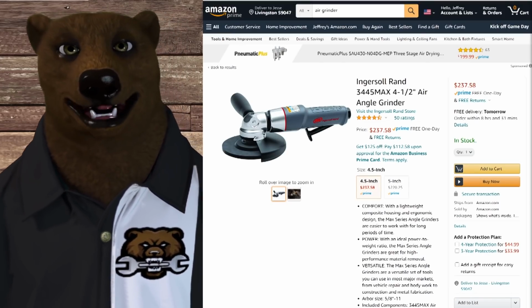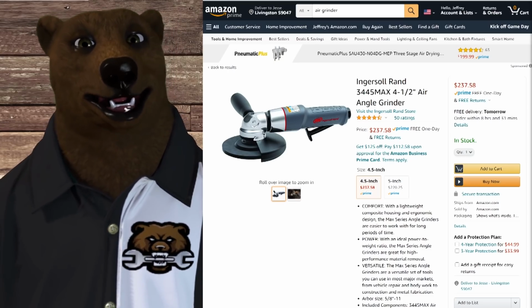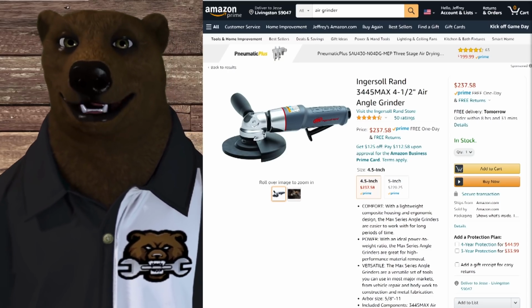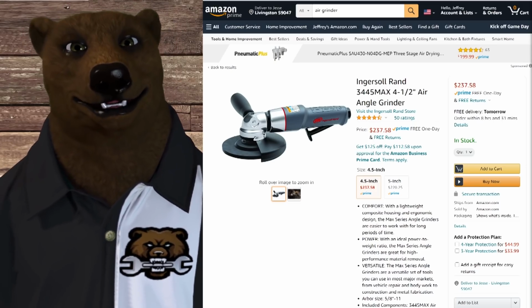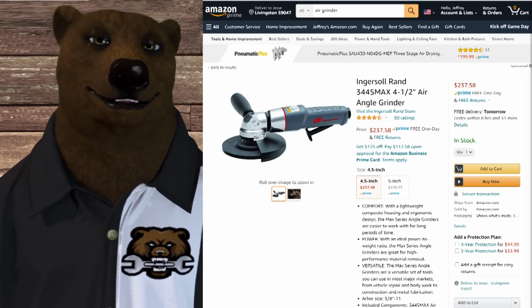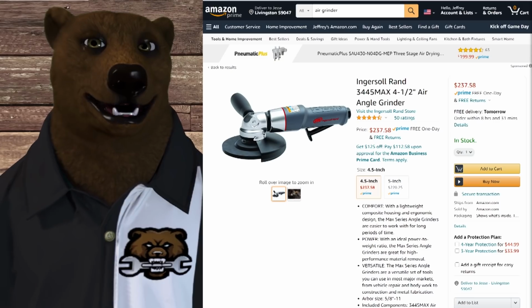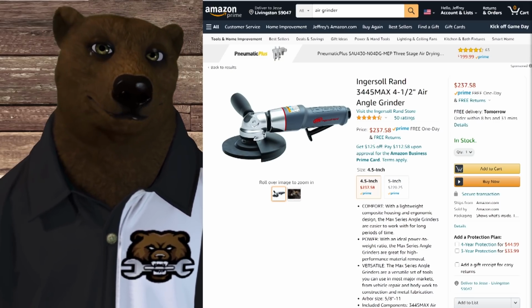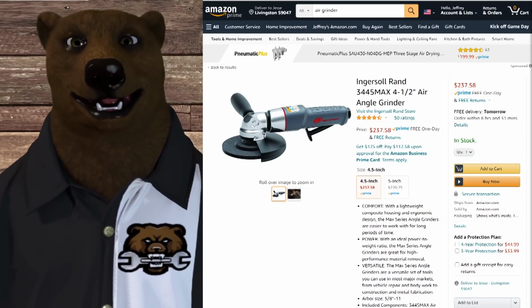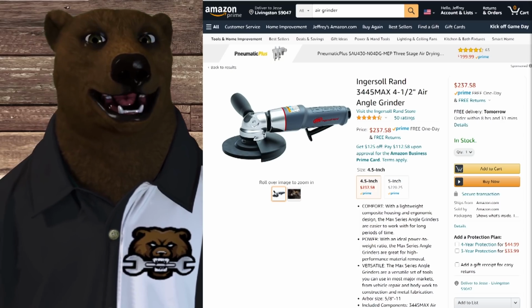But you know what's even worse than that? Getting up to the big grinders. Oh, if you want an air-powered grinder, oh my gosh, you're looking at 23, 24 CFM for something like that. You're going to need a beast of a machine to keep up with these things. As I said, if you notice, we look back and we're talking about nail guns, blowout tools, just things that are doing quick burst kind of air versus the high spin rate kind of stuff. We're just constantly going and going and going. It just eats the air.